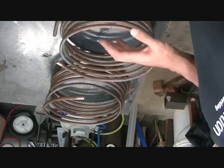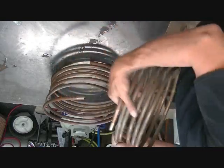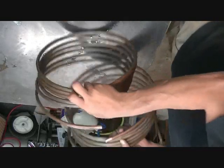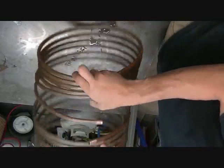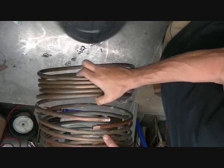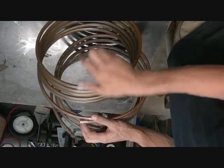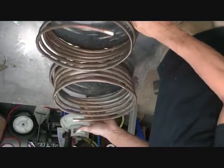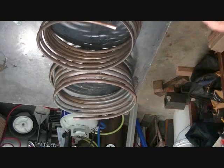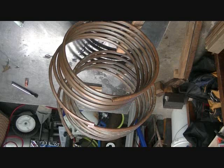And the copper is going to become very soft. So when I do make this joint, I want the joint to be in the configuration to where the copper is not going to have too much stress on. So I don't want to have them sitting up where they could sag. And then I'll line them up as good as I can. I'll put some blocks in here to line them up. And we'll make that solder joint. Or, sorry, I keep saying solder, brazed joint. We'll come back in a second. Okay, I think we're just about ready here.